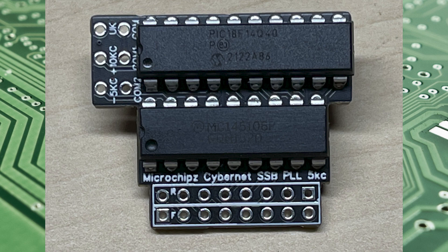This next board is a variant of the last one. It also uses the MC145106P PLL chip, so it is a complete replacement for your PLL O2A. This will give UK 40 readout from high band, alpha channels with plus 10kc where necessary, and also minus 5kc switching to drop you onto zeros — all in one nice neat package.